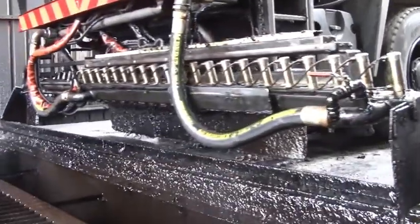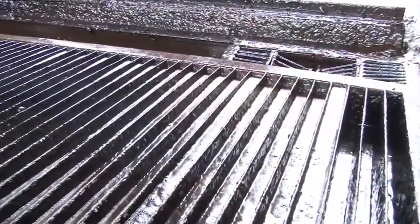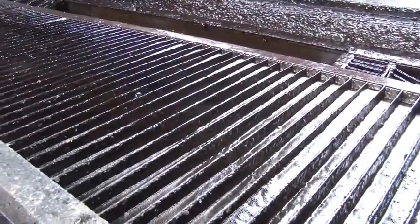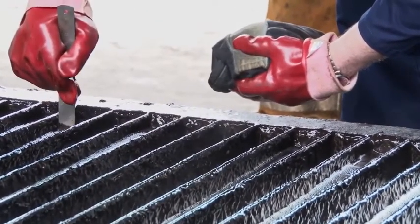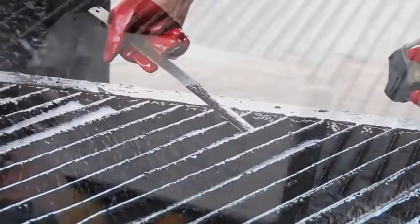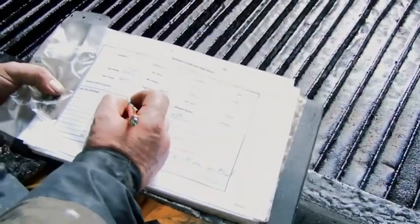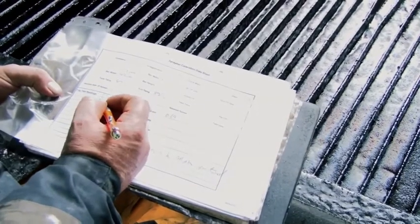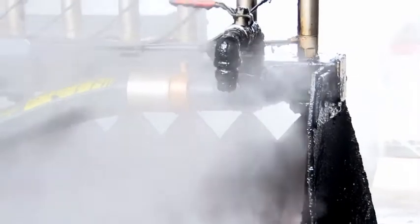This test is carried out either for slotted jet bars or for the swirl jet bars. The technician carrying out the test will check the depths of the emulsion in the individual slots in the tray, calculate the mean and establish the deviation from the mean for each section of the tray. It is most important that we can keep these within a very tight tolerance, the purpose being to achieve a uniform correct rate of application of bitumen emulsion onto the road.